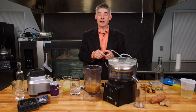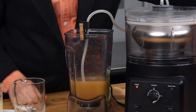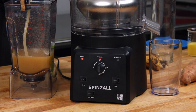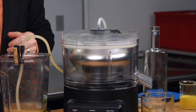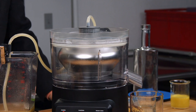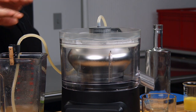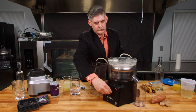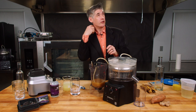It's only been two minutes, but I don't have patience and I'm sure you don't either. I'm going to show you how the pump works — you just put the tubing into your liquid and turn on the pump. That's going to pump the liquid up this tube into the rotor. When the rotor is 100% full, it's going to start spilling out. This knob adjusts the speed at which it's pumping — right now it goes between 50 milliliters per minute and 250 milliliters per minute.